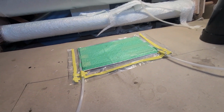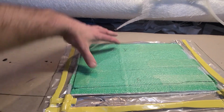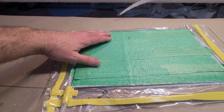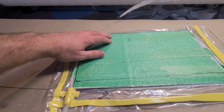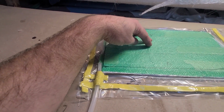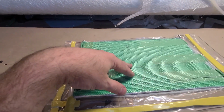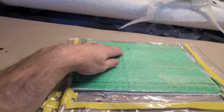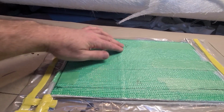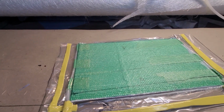I'm very excited. Well, I did the layout on purpose incorrectly. So this side, this sheet of glass, is actually CSM 1.5, what do you call it, ounce per square foot, and these two strips are just one ounce, and I see very clearly where the edge is happening right here. So this is much thicker than these layers. Well, that's cool.